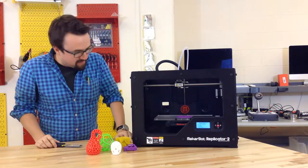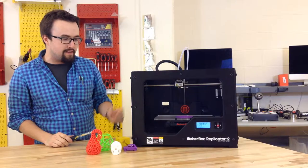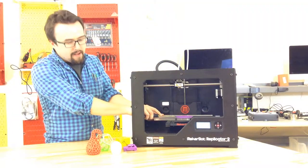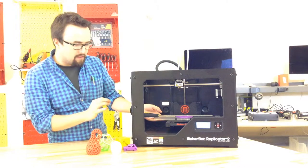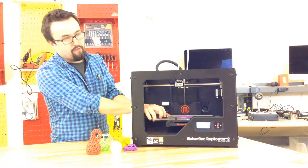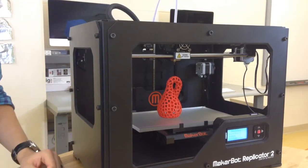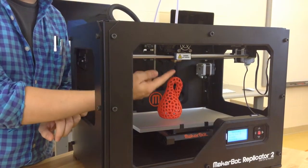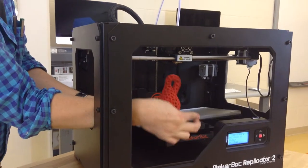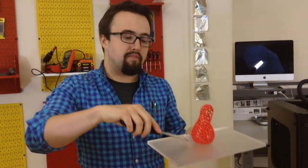Getting your job off the build plate can be a little difficult. What I have here is a standard putty knife, and we're going to very carefully pry this job off the build plate, making sure we try not to scratch the plate itself. Simply pry the putty knife underneath one end — the faster you do this after your print finishes, the easier it comes off. Lift up a little, bring your putty knife around, lift up again, and for a third time you can just pull it directly off the build plate. If you have a relatively large build and can't pry it off without hitting the extruder head, push back on the build plate — you won't break anything — lift up, slide it out, and then you can easily pry the print off with your putty knife.